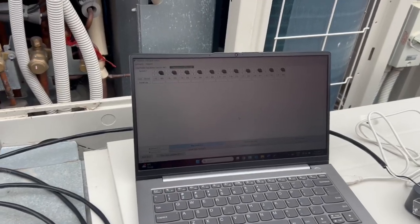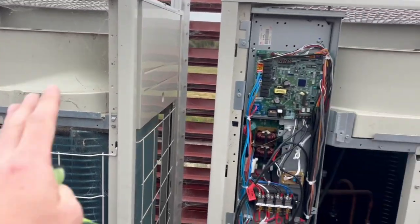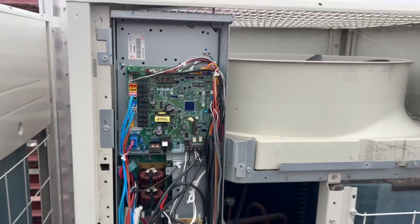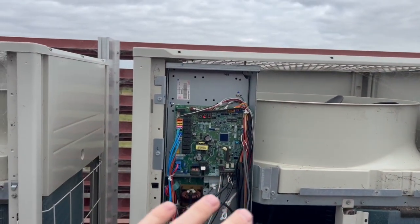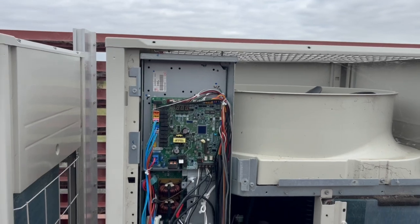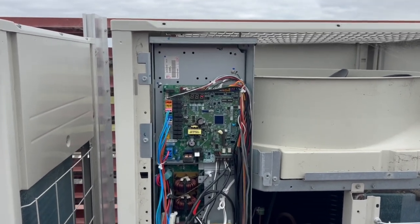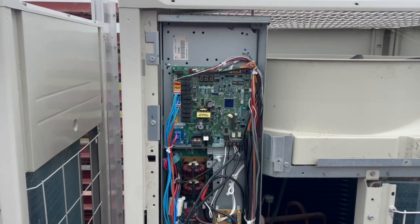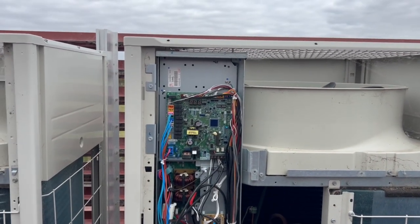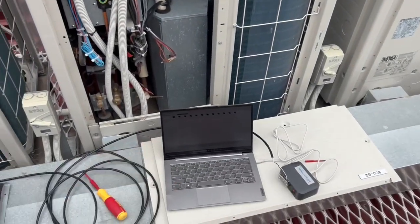Just creating the site map now. I've hooked up to this one just so we can see what's going on. This is still loading - it's probably been about five minutes now and it's still loading. I'd be surprised if this thing doesn't eventually spit a fault because it's just going through that initial startup, looking for what's out there and just not getting a signal back. So we know this board is generating the right voltage, it just doesn't seem to be getting a signal back.